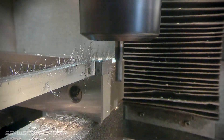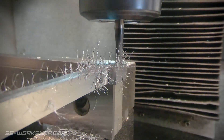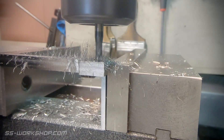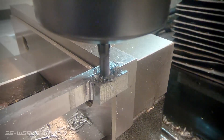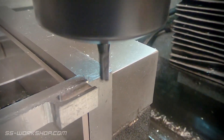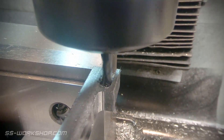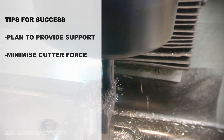With the final finishing cuts taken, it's time to cut the fork. I'm going to do this in several passes, taking about 1.5mm per path. What you'll notice is we've got a good chunk of material left on the back at this point — this is the key to making this part, with the back providing rigidity until we've made it. The thin front section wouldn't survive if we cut the slot in one pass, but the material below provides strength until we've removed it, so the only time it's unsupported is when we make the final cut. Another consideration is minimising cutter force — in this case by using a small diameter end mill.